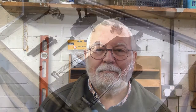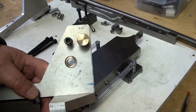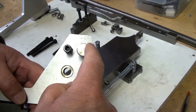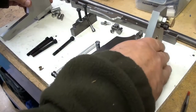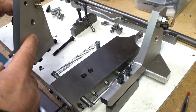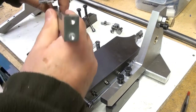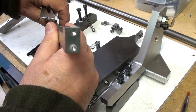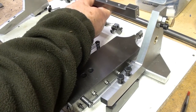I'll take you over to the workbench and we can see what I've been up to. Some things haven't changed a great deal, if at all. I've made a few alterations to the end plates — notably that I've made one adjusting screw here and a fixed point there, and reversed on the other end, so I've got a fixed point here and the adjustable one at the bottom. That enables me to fit the template holder, which if you recall I put some centres in here, and that will allow me to hold it securely between the two plates.